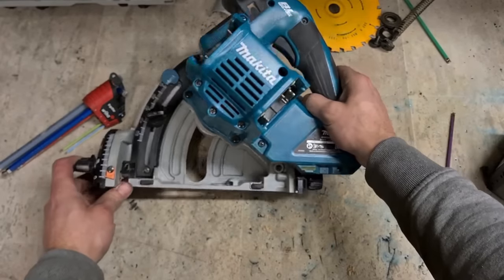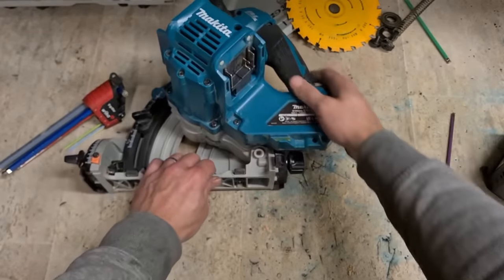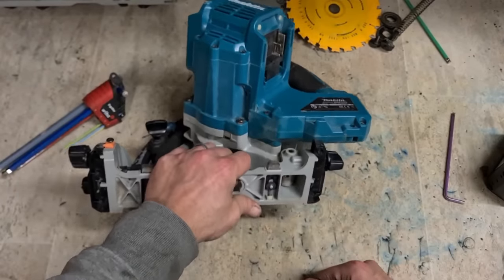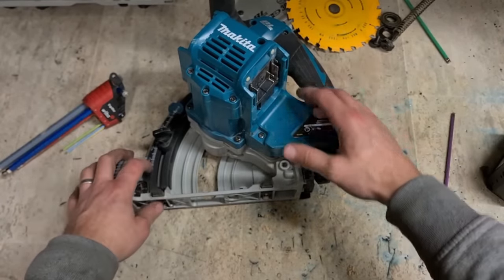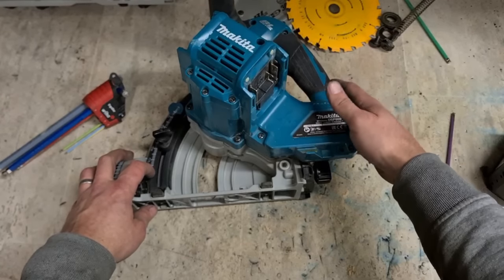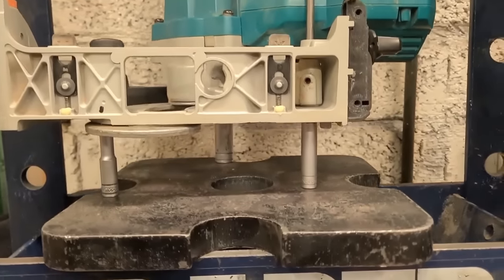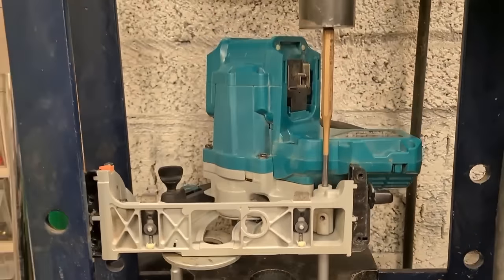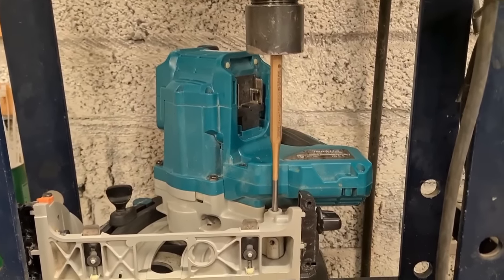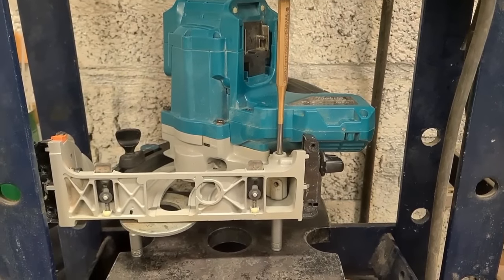So we're going to have to set this up in the bearing press. I'll press down here to press this out. And we need to support it from the underside. It's an awkward setup to have in the bearing press, and we don't have a big enough press. You have to dismantle the whole motor to make this unit smaller to get it in. As you can see, she's balanced very precisely with three wee sockets. Try to get it as flat as possible, so whenever you press down, the thing doesn't jump or move around the place.